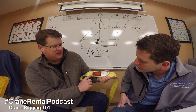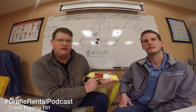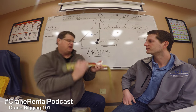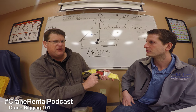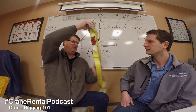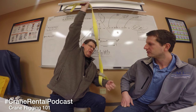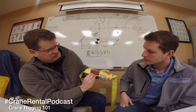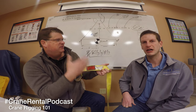Then from there it gives us a choke rating. A choke is where it naturally lies at about 130-135 degrees. The capacity is less - 2,480 pounds. For synthetic, it tends to be 80% of vertical. Wire rope tends to go 75% of the vertical capacity in a choke situation. So we call vertical 100%. Then down here you have a basket, which we generally call a 200% rating - because you have two vertical legs supporting the load. In this case we get 6,200, which is double the 3,100 vertical.